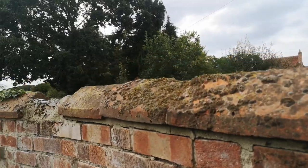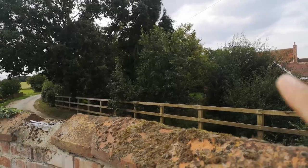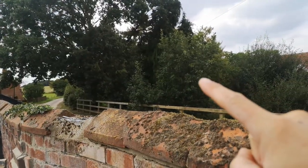And then I'll show you over there. So here's over the wall. That is a little oak, that is a big oak. This oak is closer. So foundation wise, off this corner, that's about 11 meters to that little oak. You need to calculate it as if it's going to be a mature oak, which means that this corner, if you'd done trench fill foundations, would be well over 2 meters, which isn't necessarily practical.